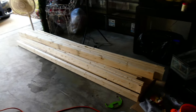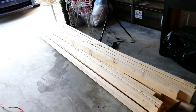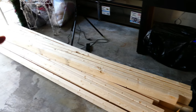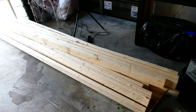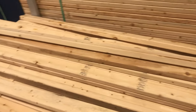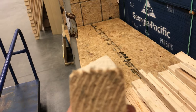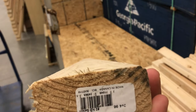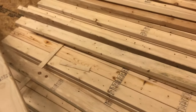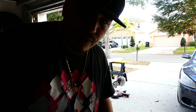It's a beautiful day today — perfect for some outside work. I got plenty of wood here from Home Depot. They cost me about three dollars a piece and they are eight-foot two-by-fours. They didn't have six-foot two-by-fours, which would have been a little better in some cases. One thing to point out: when you're at the store selecting your lumber, make sure you check it for straightness. You don't want something that's too bowed or crooked. Simply hold it up on the side and look right down the length. A big bow could cause your fish tank to crack.